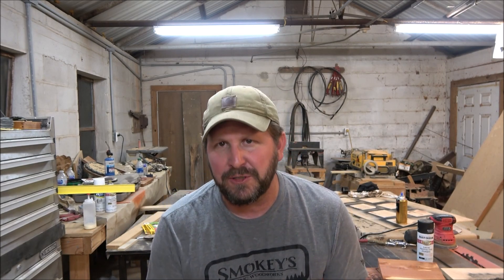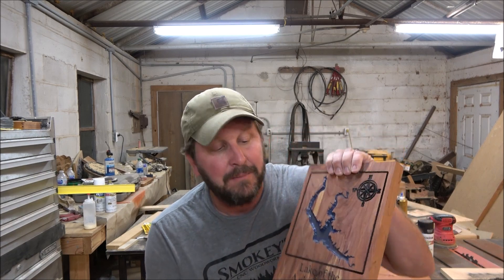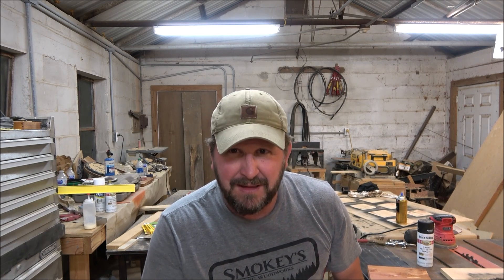I get asked all the time: do I pre-treat the wood before I paint, and is that how I get away with the overspray and sanding? Sometimes yes, sometimes no. Some woods you don't have to treat much; some you do — oak I'd recommend treating before painting and sanding. When I do treat, I use simple spray polyurethane. On the last project I tried spraying after cutting, and it worked really well. It kept everything clear and wasn't hard to get the paint off. I was using fine grit, so that may be a process I do from now on.